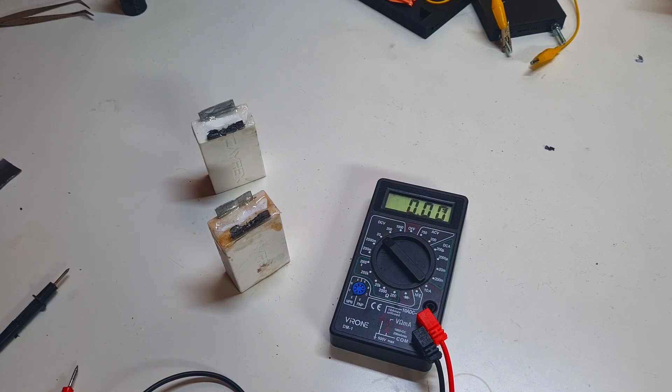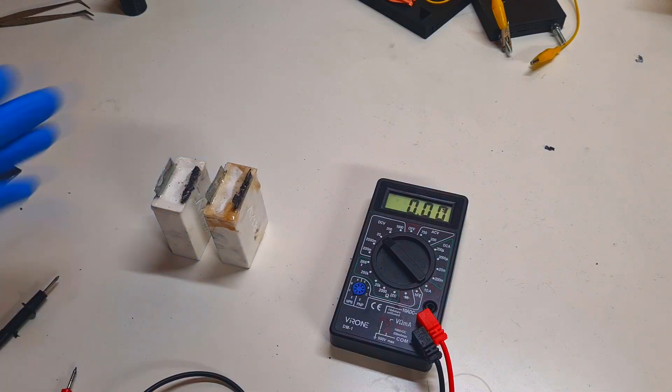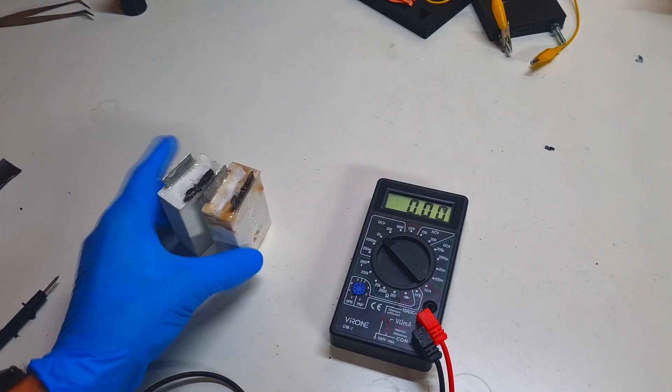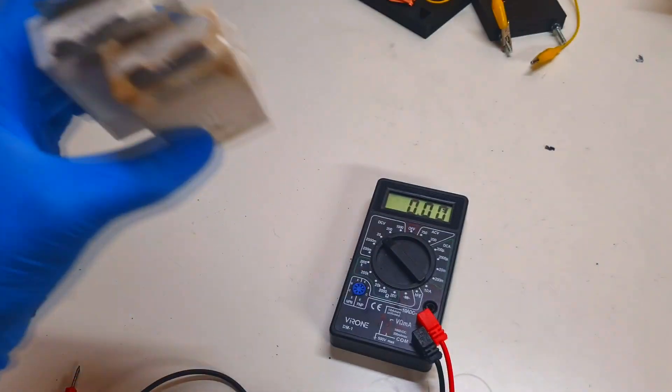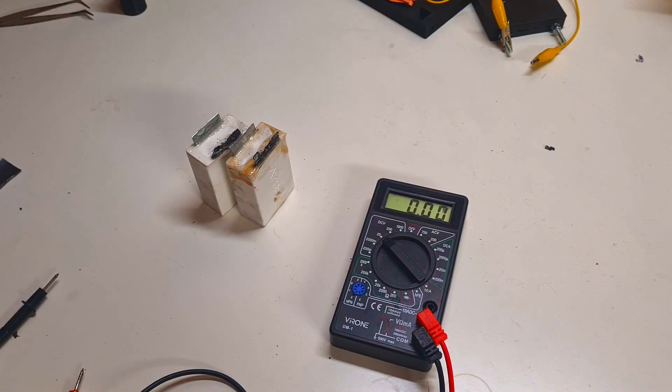So to finish, I can say that this zinc manganese battery project is not so bad after all in terms of self-discharge rate, because I'm getting 2 to 3 percent per month. So guys, this was the video about the self-discharge rate of this zinc manganese battery with this cell design. That's it for now — see you in the next video. Bye!